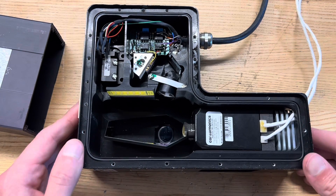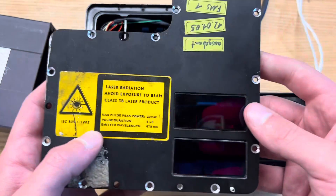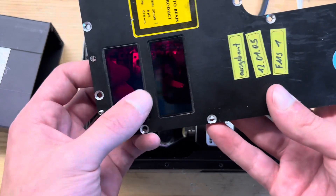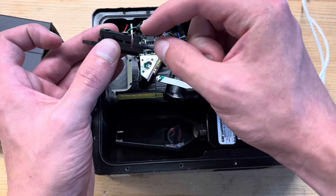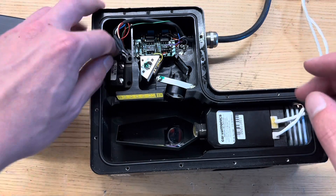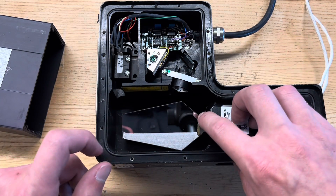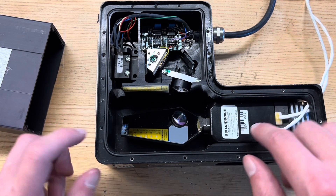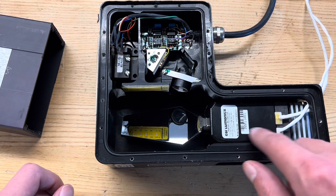Here are the internals of the sensor. There's a laser right here — it's a pulse diode laser with 675 nanometer wavelength. Hence these windows to only let 675 nanometer light through. There's a neat little assembly here for diodes held in this clamp, and then we've got a collimating lens in this assembly. It bounces off of this mirror here, which is loose on the shaft right now so I can spin it around, but when it's tight it doesn't want to spin very far at all.